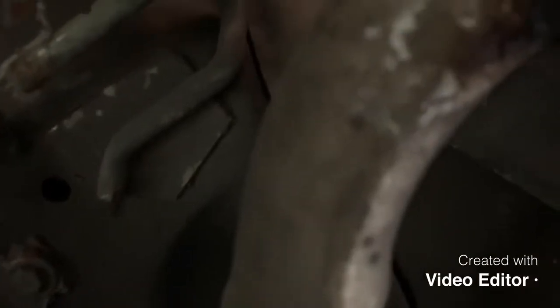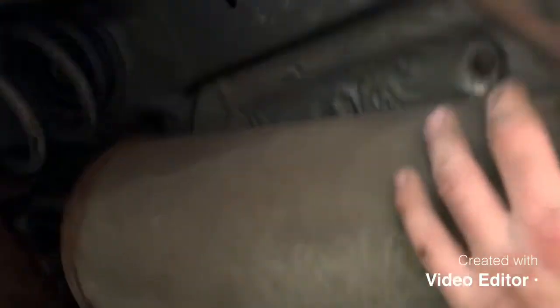The whole thing is literally bending - it's going to snap. I'm going to put the camera down and deal with this mess of rust. Try not to get rust in your eyes because that's not nice - it put me in hospital. I might just snap this off then prise the pipe up at the end. It's a mess - it's all just falling apart in my hands, but you get the idea. Get the box off and any excess bits of rusty pipe off, and then we'll look at cleaning the end of that pipe up before putting the new box on.